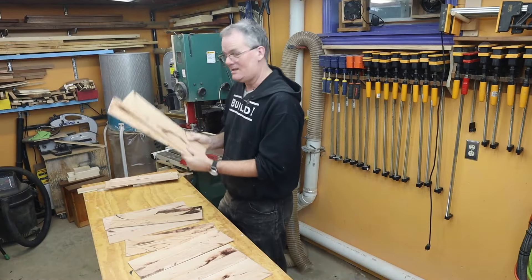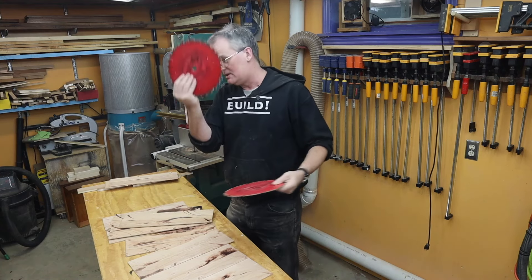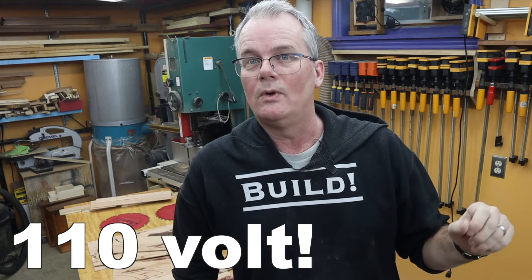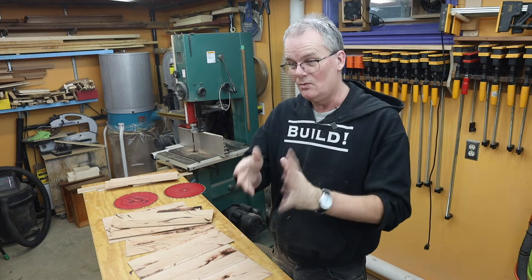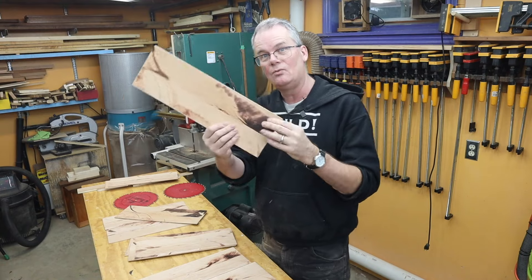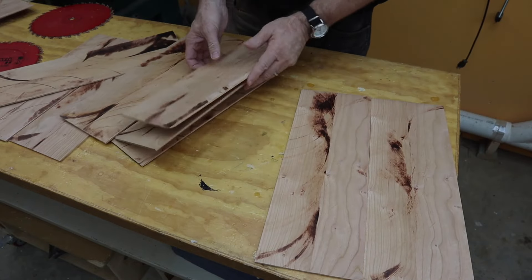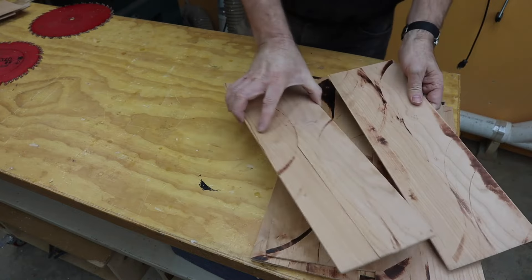I made it — got all the pieces I need, and two saw blades I definitely need to clean pitch off of now. Switching from the combination to the ripping blade was definitely a smart move, but I was really pushing my table saw to the limit. I have a two-horsepower, 120-volt motor. I still pushed it to full depth because I didn't want to do four cuts due to pinching — doing it with two cuts managed to make it work. There's still a fair bit of burning, but I have eighth-inch-thick pieces, so there's plenty of wood to allow for sanding. Cherry will burn if you look at it the wrong way. I need two for each panel — there's one, its back side, the next panel, and its back side — and I still have a couple extra pieces.